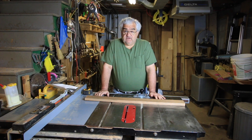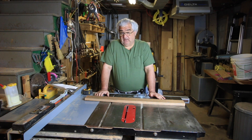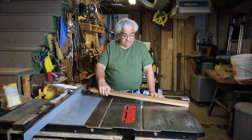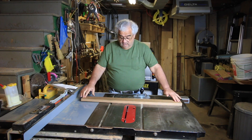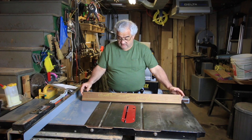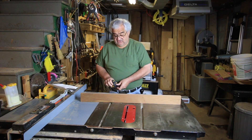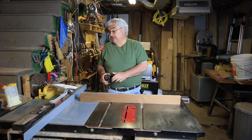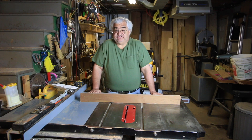If you remember the video I did on how to go to a lumber yard, I mentioned buying extra lumber — this is why. Occasionally a board, when you get it cut out of its full length — this board was seven feet long — over time you can see it moved. And because it moved, we may not be able to get it to the thickness we want. This board is fifteen-sixteenths of an inch thick right now, so we have a little bit of play room, but I don't know if we have enough to get that whole curve down.